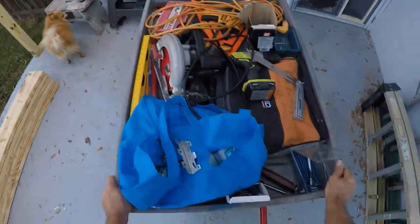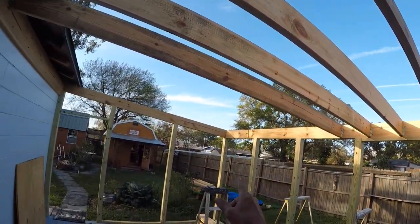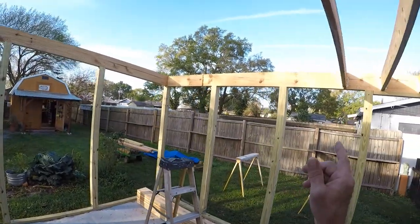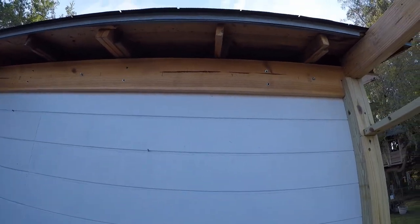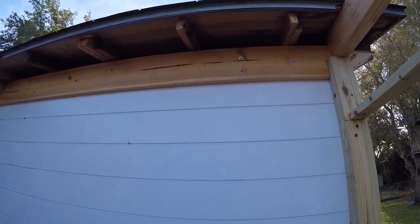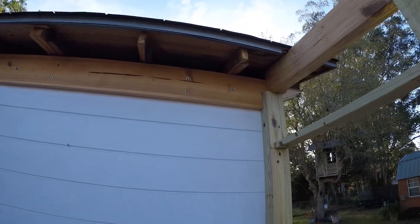Start the layout with six more rafters. A little bit of layout work to do there on this side. That blue mark is a center, so we shouldn't have to do anything there. We might have to notch that a little bit. That old rotten board is the existing roof rafter or truss, and they got that scab on there that's about four foot long. Those should go pretty smooth.